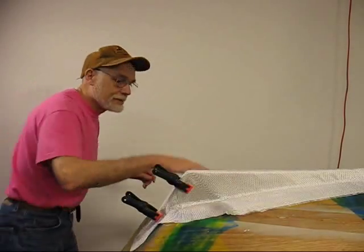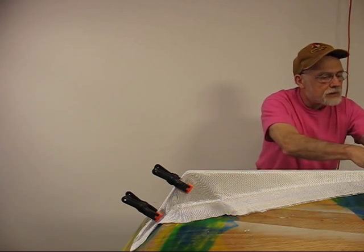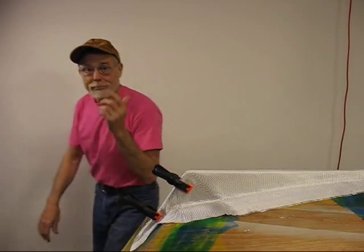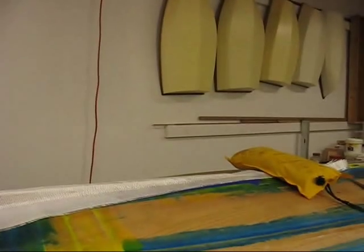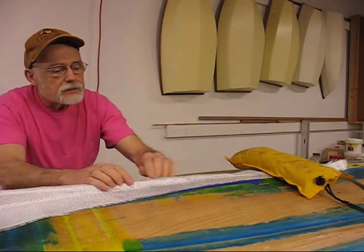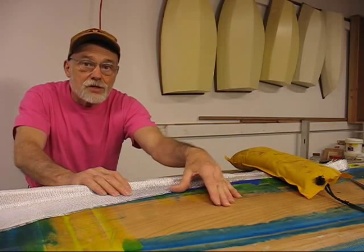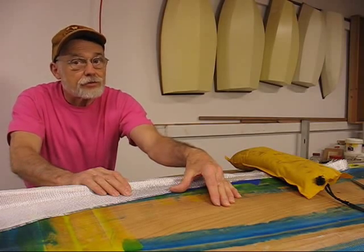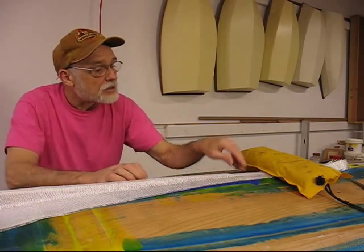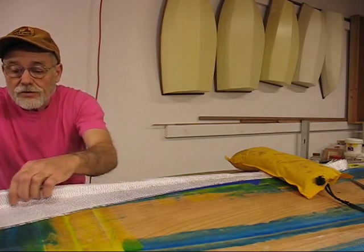This is just the first rub-out. The thing you have to worry about now is pressure ridges — come down and use your fingernail like we said before to rub them down. I've run a piece of blue tape along the outside edge of the three-inch tape that ran along the seam. That will give me a nice even straight line to cut to. I have a little delta up in here and then I'll let this set for a day or so.